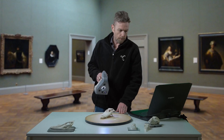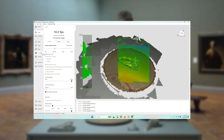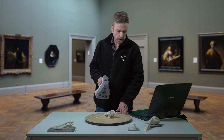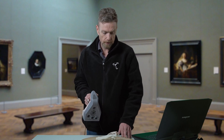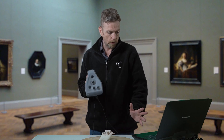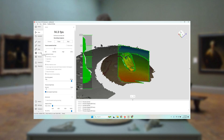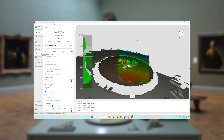What I'm doing is keeping the skull here in the field of view of the scanner, and I'm trying to capture images around and across. You can see that I'm going quite quickly. Part of that is because I have a lot of scan experience, but a lot of it is because the scanner is just really easy to use. I haven't really lost tracking. If I lose tracking and don't know where I'm at, I can point the scanner back at the object and it will continue to scan. Usually we go around a couple of times and try to get underneath and into small areas.